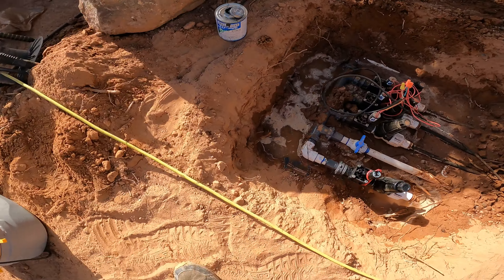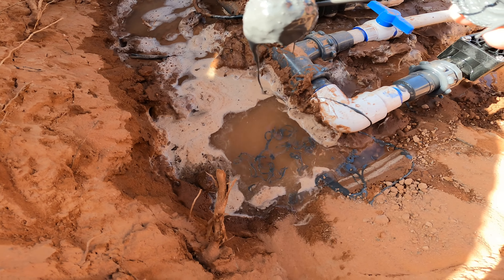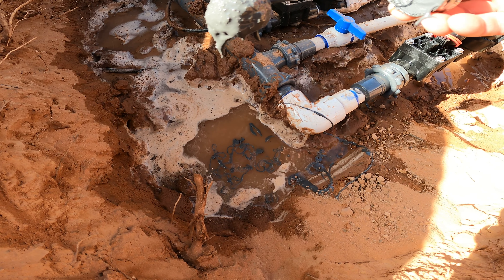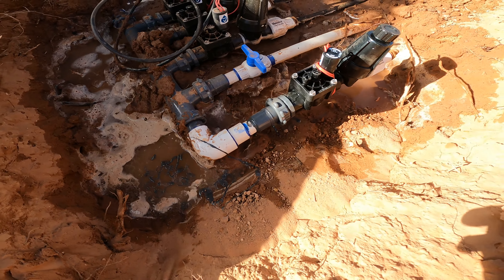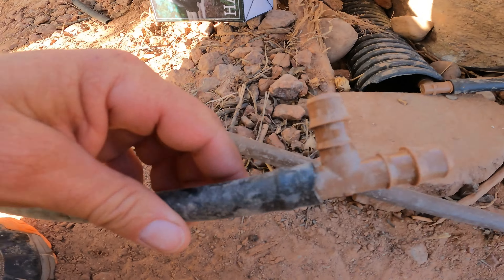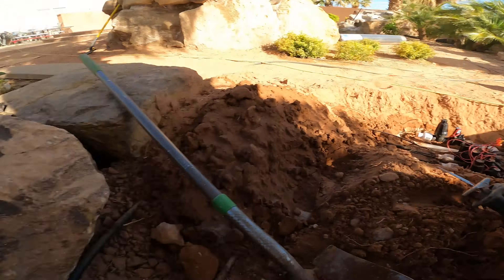Got her glued in. Funny thing is when the glue gets in the water it kind of goes crazy — doesn't really mix but it sure likes to dance around, like little tadpoles swimming. Got my valve glued in. I'll run another drip hose from that end over to right here. We disconnected that T, put a 90 so it went into only this one — now I'll couple into this one and run it into that valve, it'll be all by itself.